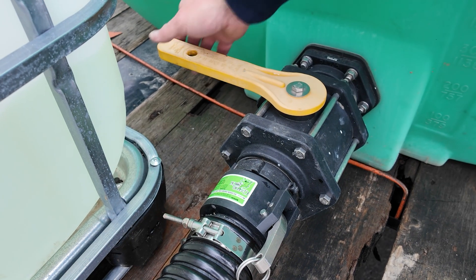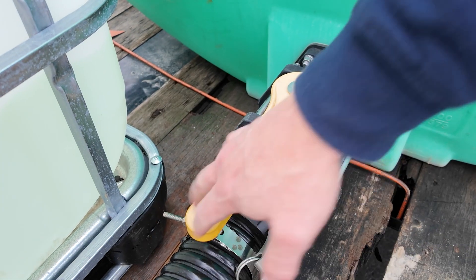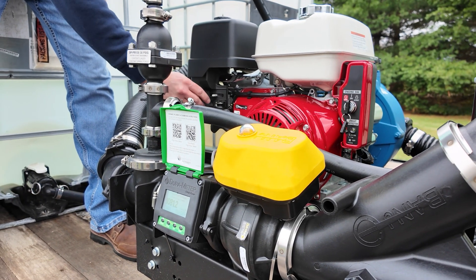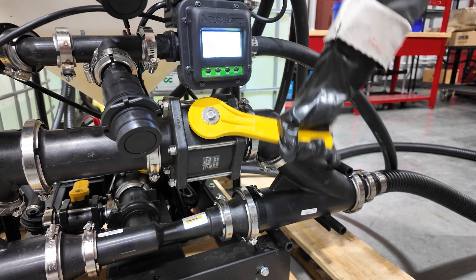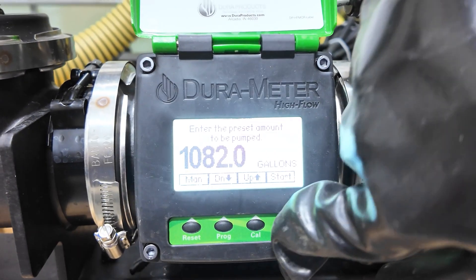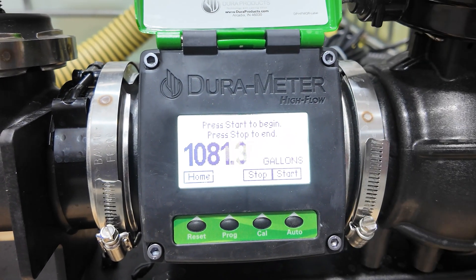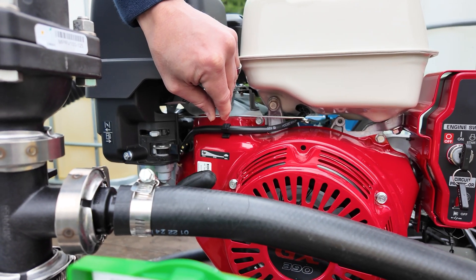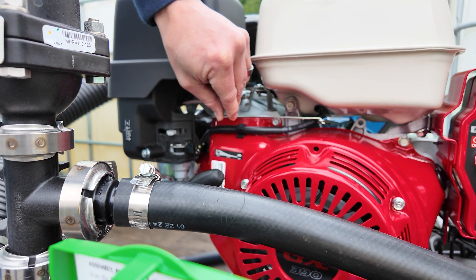Open your water supply and fill the transfer pump housing. It may be necessary to temporarily open the outlet connection of the pump for a complete prime. Open your 2-inch or 3-inch bypass valve on the induction portion of the system. Start the batch for the Auto Batch high-flow meter after the transfer pump — the valve on the carrier line will open. Start your transfer pump and increase the engine to full throttle.